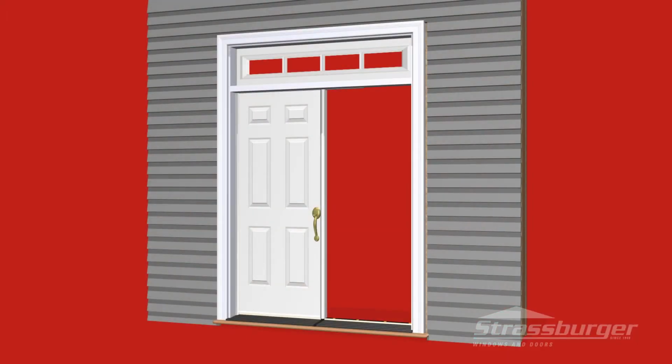If your door has a transom attached, this is the last part of the door system to secure. Prior to securing it to the structure, cut a 2-inch by 2-inch piece of lumber that measures 2 millimeters longer than what the opening is along the hinge side, from top of sill crown to underside of the header. Place the wood in the center of the opening alongside the astragal of the inactive door slab. Once in place, proceed to fasten the transom.